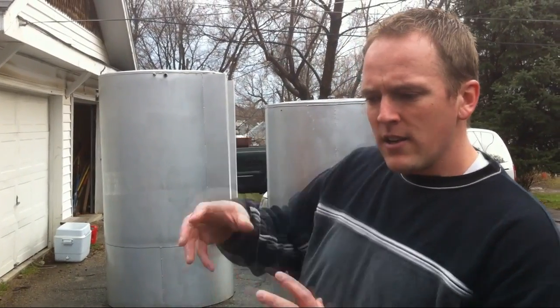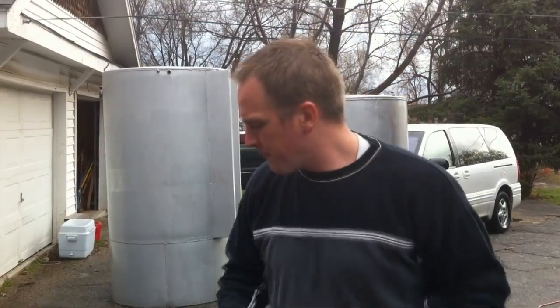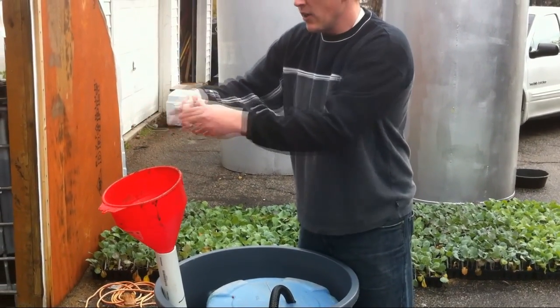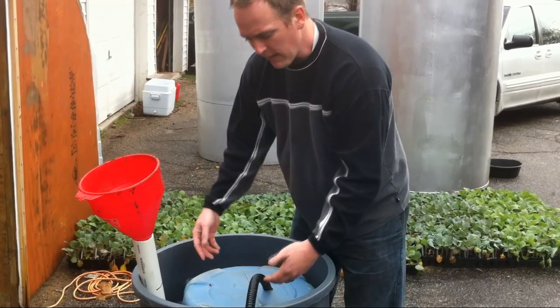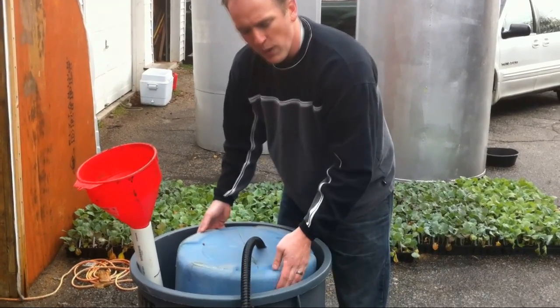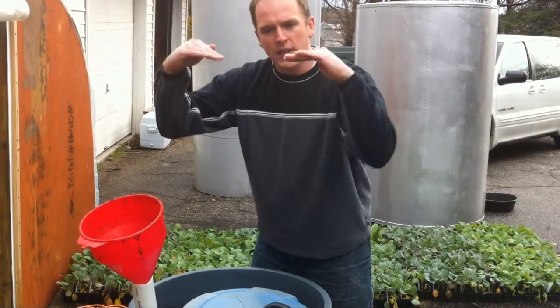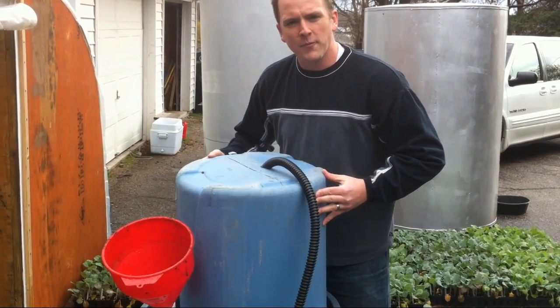Here's one real simple method where you take two cylinders. You put food waste, manure, and everything else in there, and as it breaks down the methane bubbles to the top and forces that upper cylinder up. It holds and pressurizes the methane so you can send it to your utilities or whatever you're going to use it with. As you use it — turning your cook stove or generator on — this thing goes back down.